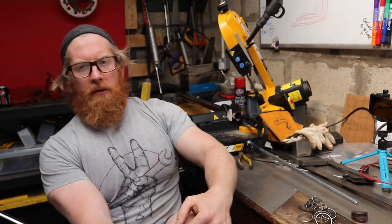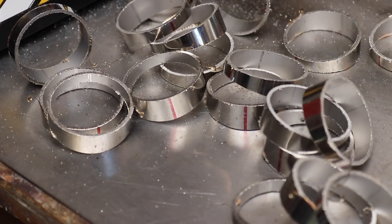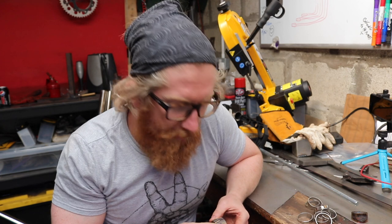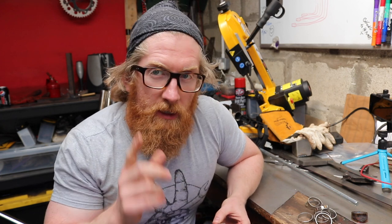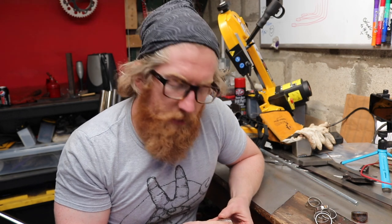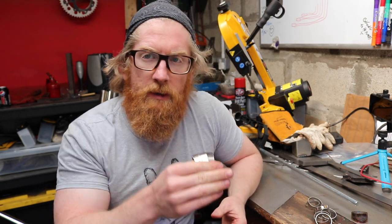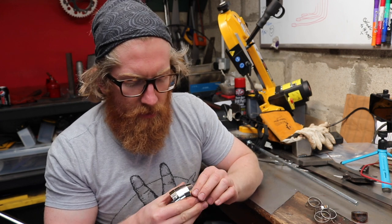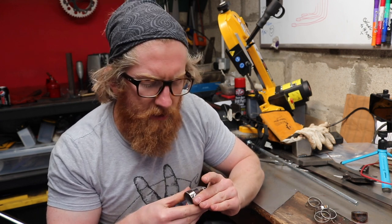So we've got 10 bits. 10 bits should equal 90 degrees, because 4.5 degrees each side equals a 9 degree transition angle. 9 degrees times 10 equals 90 degrees. Even I can figure that math out. I'm going to have a stab at welding these together just on my bench. This is going to be a slow process anyway.